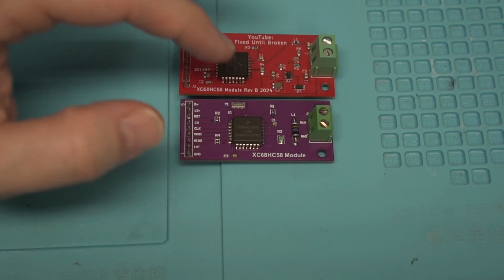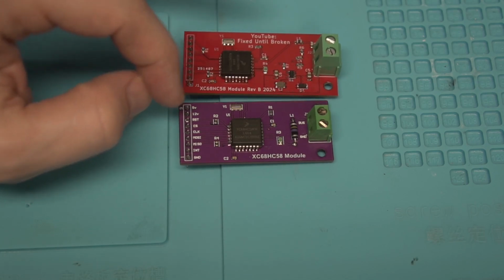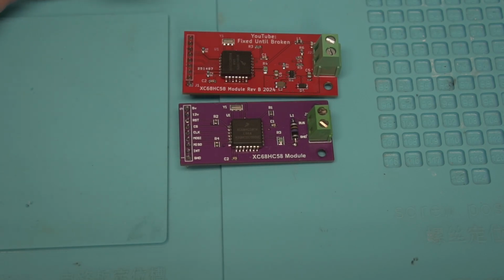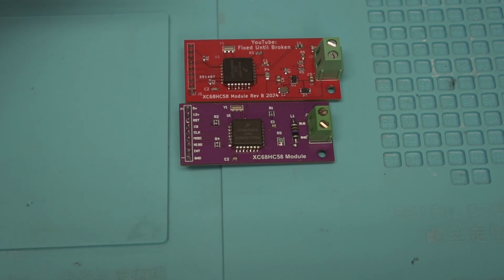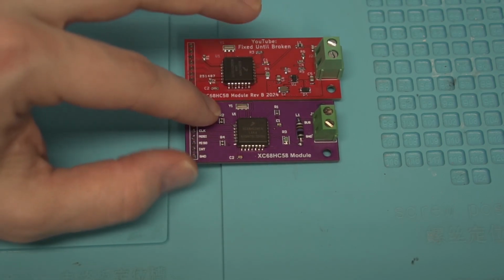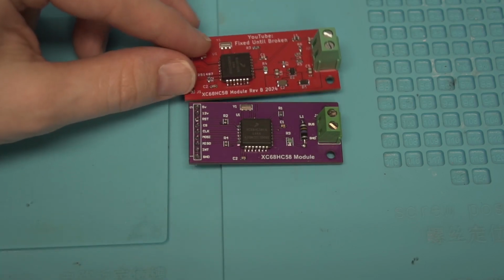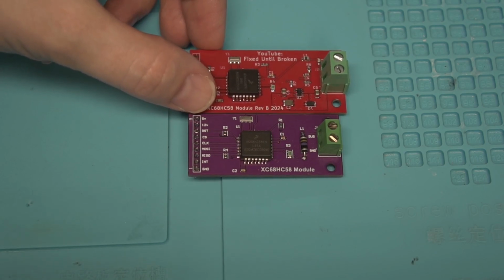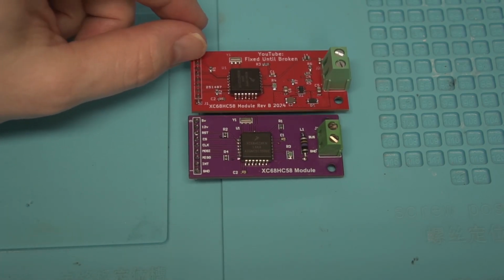You know, it's pretty much the same thing. All of these pins have the same pin assignment. However, the 12 volt pin just isn't used in this case. So same pin assignment. That way it's a drop-in replacement for the Rev A. Just hopefully if you did do it, you didn't put standoffs there because they aren't going to line up anymore. But yeah, it's plug and play, it's ready to go, and it doesn't need 12 volts.